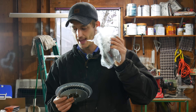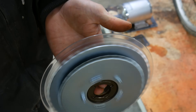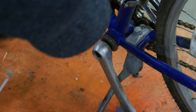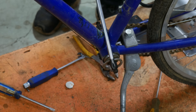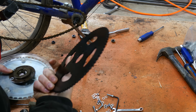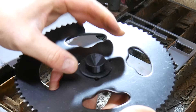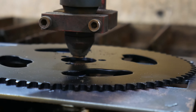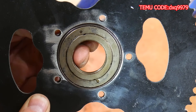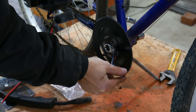Temu also sent me a jackshaft kit for a motorized bike. It has a freewheel attached to the sprocket cassette, which decouples the pedals from the crank so the motor can drive independently without rotating the pedals. The electric motor comes with a different sprocket so I had to buy a new one to replace the outer ring on the crank. I 3D printed a nifty jig to help center my plasma cutter, and then big bada boom.